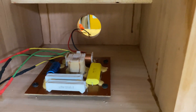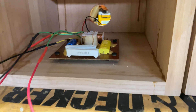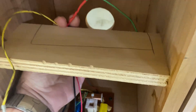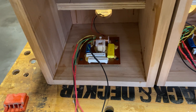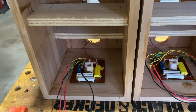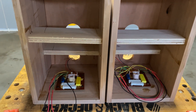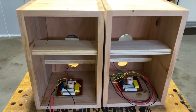The speaker wire going out back is set up to connect to the terminal cup, and we added all this extra length — it's needed because now we can route up over that brace and connect to the tweeter. I added a little more than I needed on the woofer side, but that's okay — I'll probably just lay that off to the side and tape it down. Next up, we have to add the dampening material and then get the front baffles drilled out or routed out, and then we'll be able to load this all up and get it done.